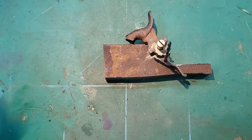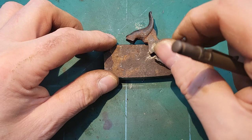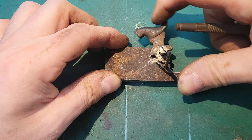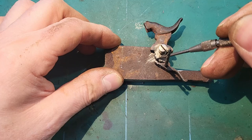So I've got my jig set up now. That's screwed into the plate there, and that's just the drill bit I used to drill the hole, holding that in place. So now, when that heel of the hammer nose sits there, I know that it's going to be contacting the top of the nipple, and I can simulate what's happening with the lock inside the gun. So there's a notch there. I think that's the remnants of half, and then we'll need one further down for full.